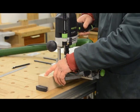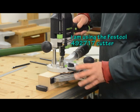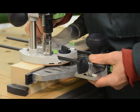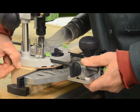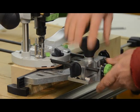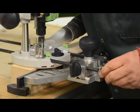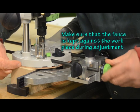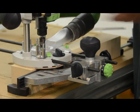I want to do a trenching cut through the centre of this piece of hard maple. I've put in a double flute cutter and attached the guide fence in roughly the right position. The first job is to get the centre line of the router lined up with the centre line on the wood. I'm moving this forward and you can see the centre line indent marked on the router — I want to get that in line with the pencil mark I made earlier. I release one clamping knob to make fine adjustments using the fine control, aligning the centre line of the router with my pencil line marking the centre line of the wood. Once those are in line, I tighten that up and the fence is adjusted.